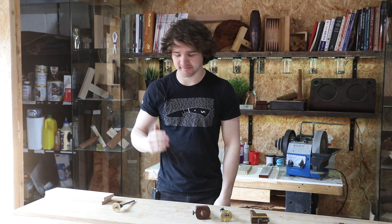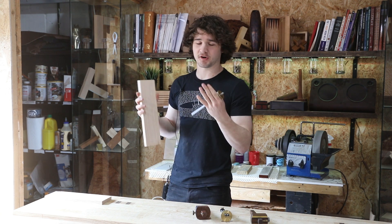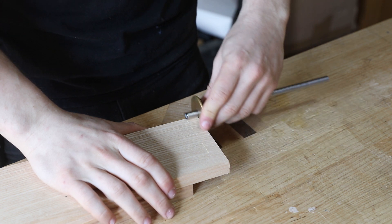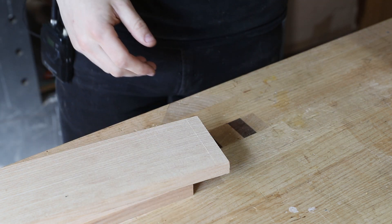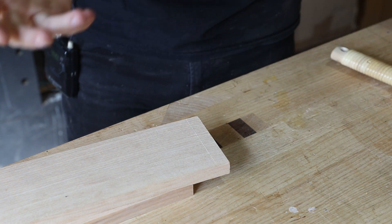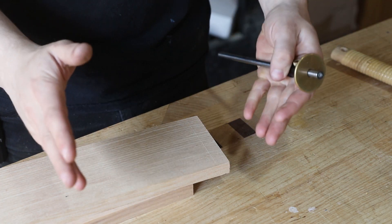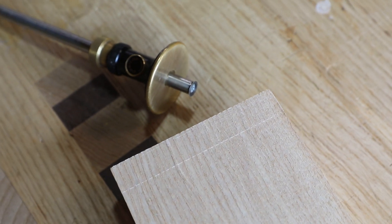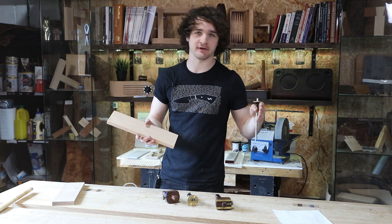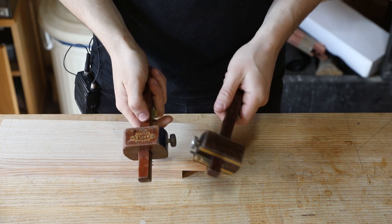One of the things you might hear is should I push or pull the marking gauge towards me while marking out. I am telling you now it does not matter. Some people will tell you to push it away from you so you can see what you're doing. Just try both - if one way works, do that. I personally like to pull the gauge towards me, I just find I get a little bit more control, and generally my students find it a little bit easier as well, probably for the same reason that it's easier to use a Japanese saw. Cutting on the pull stroke tends to be a more natural motion, but it doesn't matter - whatever works.